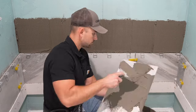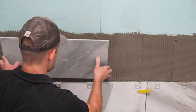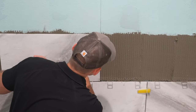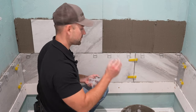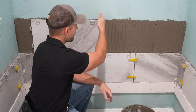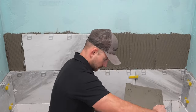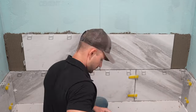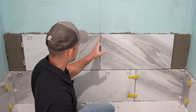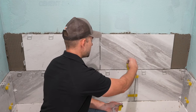If you want to line up your grout joints and not have them staggered, you can do a vertical line to reference the edge of the tile as you go straight up. We're going to use the center line as a guide for the center of the grout joint, eyeballing it right to the side of that line. Place spacers into the sides of the tile right in line with the center wall line. Now install the tile beside it and continue the run just like we did below. My best advice if you've never done this before: take your time, have patience, and do a lot of research before starting.